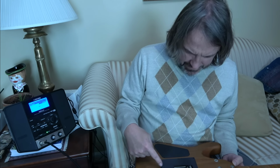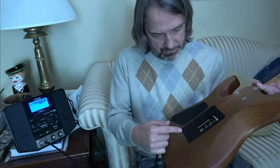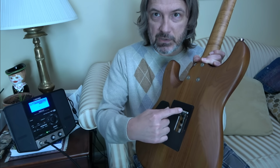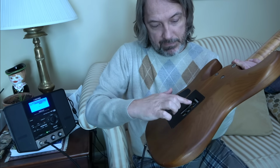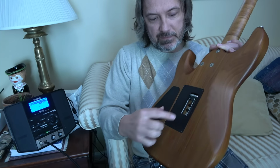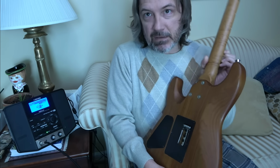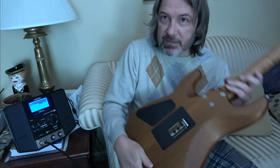Furthermore, as this thing moves up and down, the angle at which these two objects meet is going to change the whole time. So the angle of the shaft would have to change along with this piston, because when it moves, the angle is changing, or it's trying to change. It's not merely moving straight in and straight out. It's moving downward at an angle, because when you pull down on the bridge, it's dragging it downward at an angle.